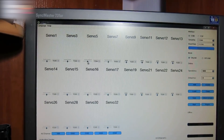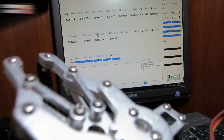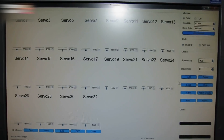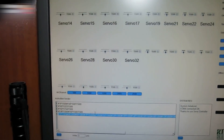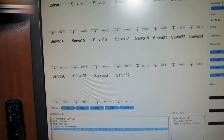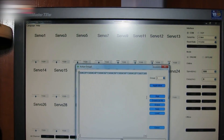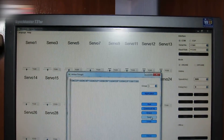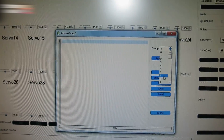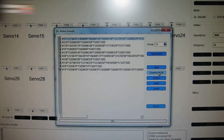Take servo 16 — oops, it's actually servo 5. Here is servo 16. Move the scroll bar; the claw should move accordingly. Once the servos are set to the desired position, click Add. A message should appear — copy the message. Click Action Group, select a group and paste it here. Click Application and then Save. I created several action groups for this; some of them are empty and some are not. Now click Download All. All the action groups are moved to the microcontroller. Wait about a minute.